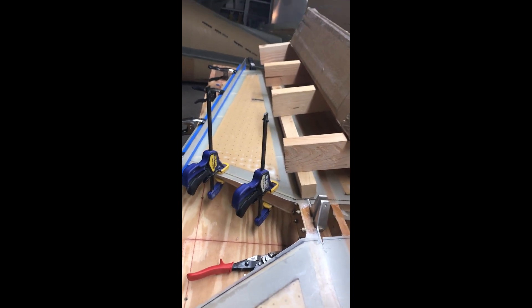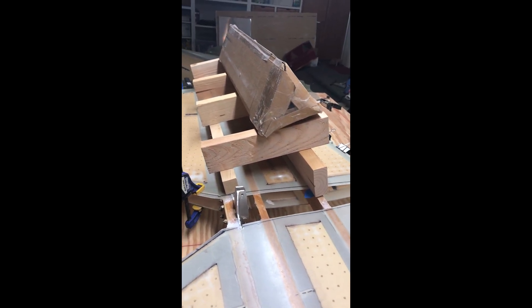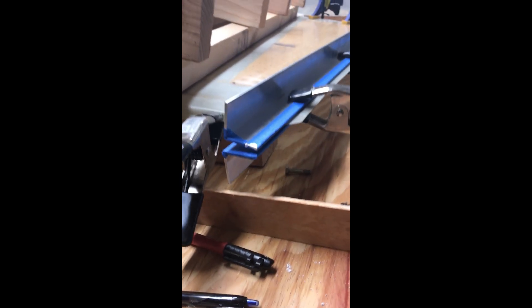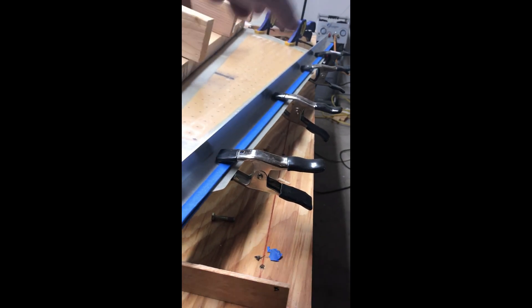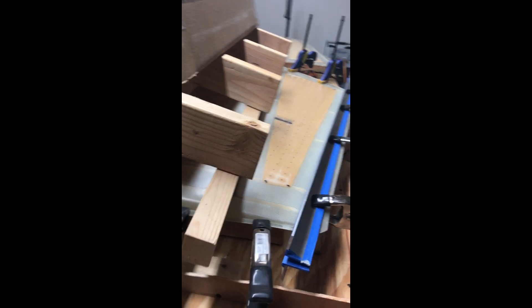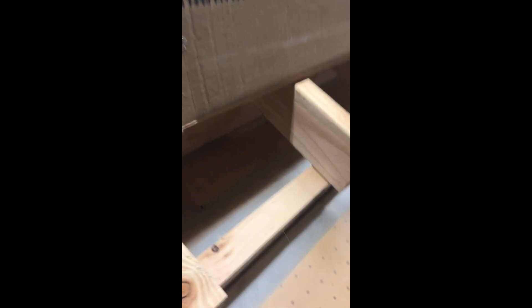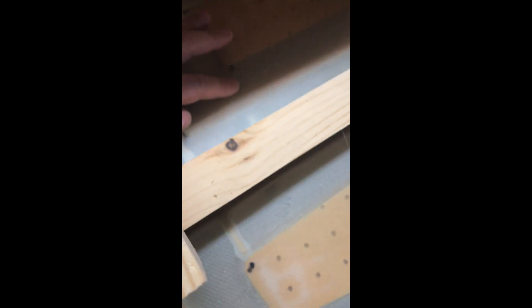This is going to get trimmed back anyway, so I'll be trimming that all off, same with this back piece here. Just finished gluing that one on. So that's the closing up of the horizontal. On the trailing edge, I've got two pieces of angle iron clamped together with about an inch of flox in there, so I've got a nice straight edge for the trailing edge.